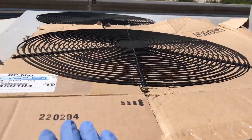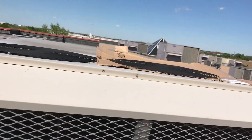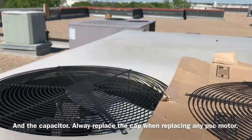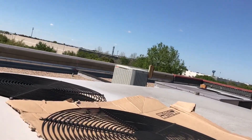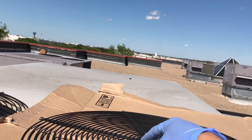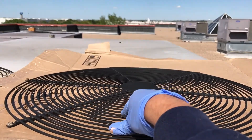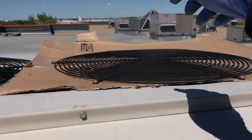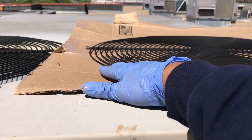I switched it with another relay just to make sure the fan is gone. When this fan is running and this fan is not running, it will want to suck in air to the top of this fan. Remember, air is lazy — so instead of air going across your coil, it's more likely going to be coming in through here and going back out. So just cover it off to make sure all your air is coming through the coils.